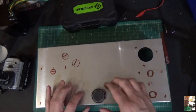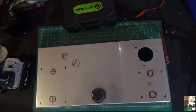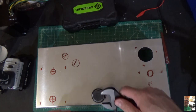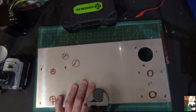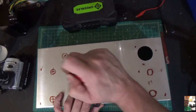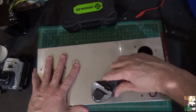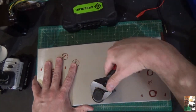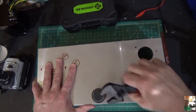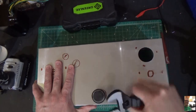Okay? And all you do is you take a wrench and you start tightening. So let's get our wrench. And that's a 1-inch bolt on top. So we're just going to start turning. And what's going to happen is you're going to hear 2 very distinct pops. There's going to be 2 pieces when this thing is done that come out inside the die, and I'll show you. Let's just keep turning this until we hear a pop. Should be coming soon.